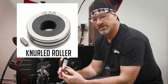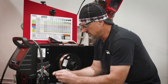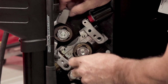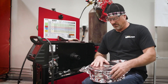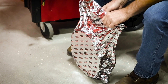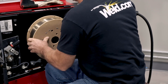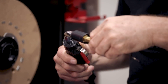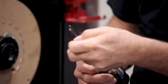You want to look at the rollers because some rollers come with different sizes on either side, so make sure you have the right side for the right diameter wire you're going to use. So 045 — there's 045. Click it in. Next, we'll pull the spool off and put the other spool on. Lincoln puts the wire in a nice package, so when you cut it open, you want to cut it so you can reuse it — because if you take the spool off and reuse it, you want to package it right so the wire doesn't go bad. Then put the tip on, put the cup on, trim the wire a little bit. Now we're ready to weld.